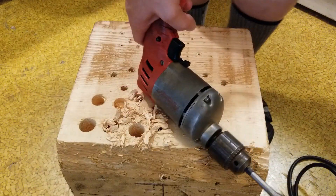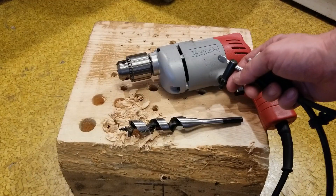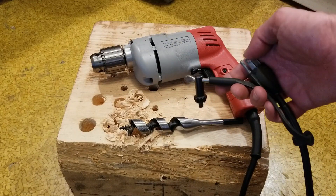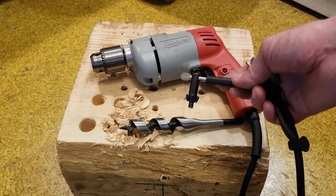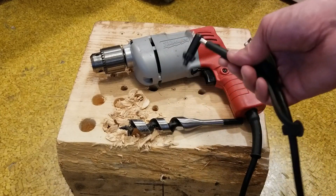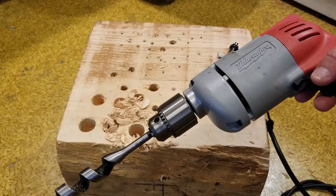Although with modern tools, you just have to make sure the vent fans aren't covered and they'll generally be okay. Nowadays it seems like the old half-inch drills are what's replaced these, because they're a larger tool with basically the same size motor running at the same speeds. A modern DeWalt half-inch drill is 1,000 RPM with an 8.5-amp motor and about 30% bigger than this, and they get pretty good reviews.